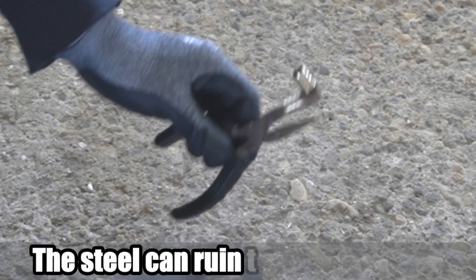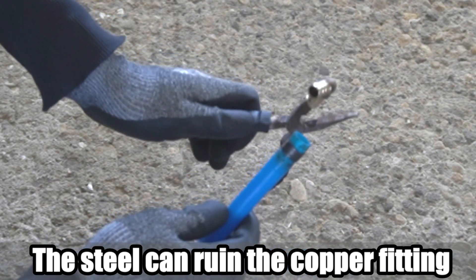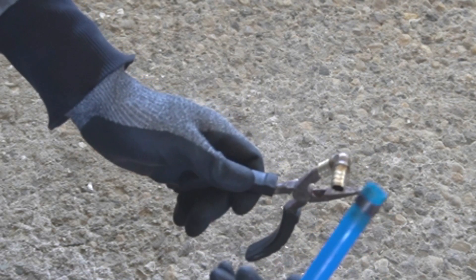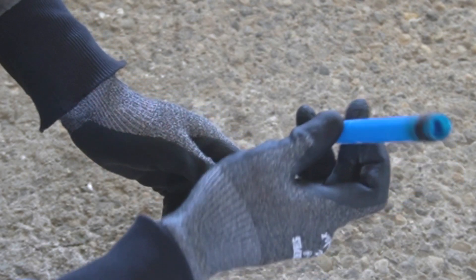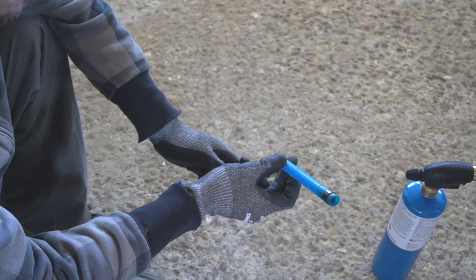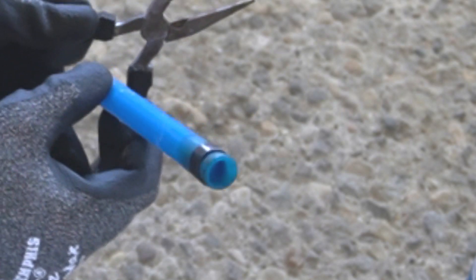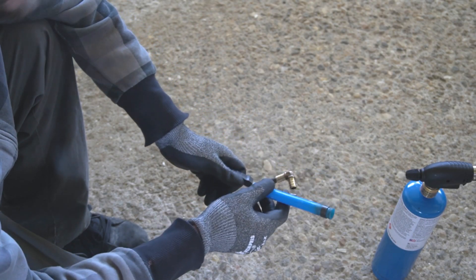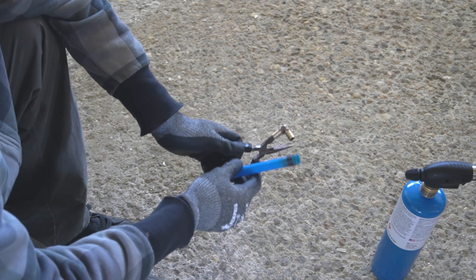So this sucker is hot right now, so I'm going to try to be careful here. But I was able to remove it with just a torch by heating it up, just like a marshmallow over a fire. The PEX slowly lengthens and you can see the PEX kind of expanded and created a little bit more separation. So I was able to slide the elbow joint off. If you do accidentally clamp it on a joint, you can take it off using a torch.